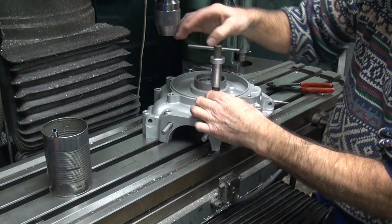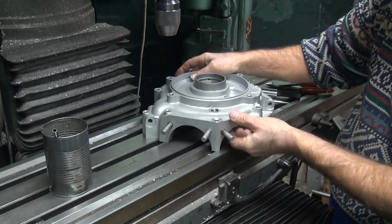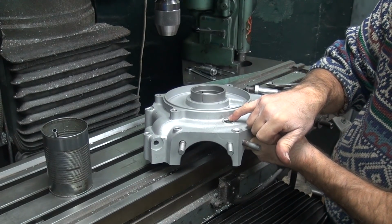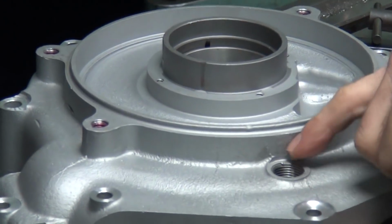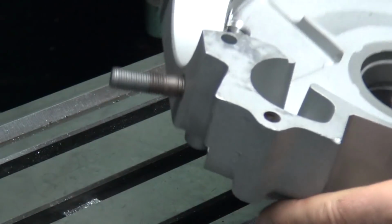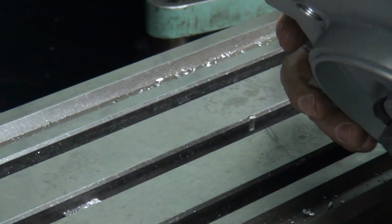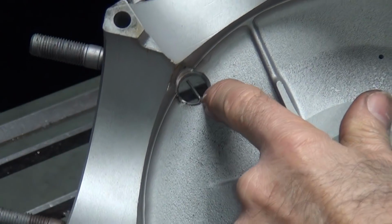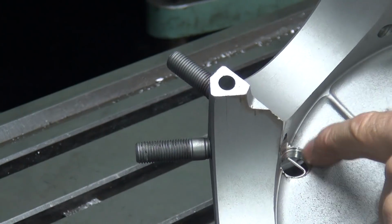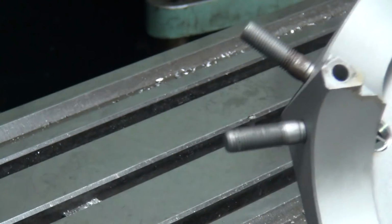Okay, we're coming through the other side already, I think. See, right here, we're flush right here. So if you don't go in deeper, it'll leak because the pressure will be on the helicoil and not on the case to seal it. Now you go to look at your tang where you're at over here. So see how we're starting to go into daylight over here? Mm-hmm. Now if I can catch that tang over there, and this is in the inside of what we need, we can run it. But I don't think it's gonna...